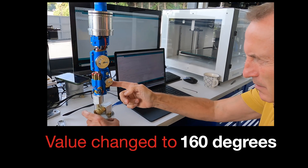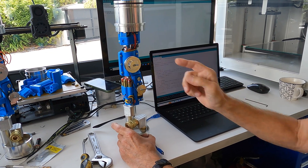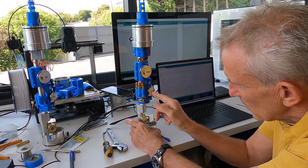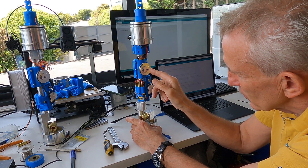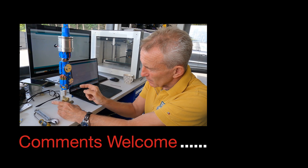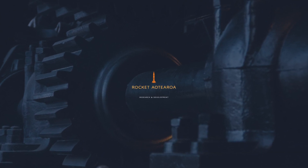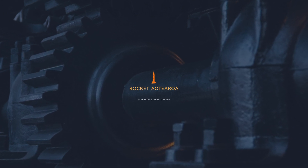That's a servo — that's the type of motor driving the ball valve. It's the correlation between what angle you've told it to move, and you want that moving 90 degrees, from 0 to 90. By coming smaller on the pulleys we get more torque delivered, so it's a good thing. Bloody good work — first time! It's bloody amazing really — when you see it it's complex, and it worked first time. Let's watch it again.